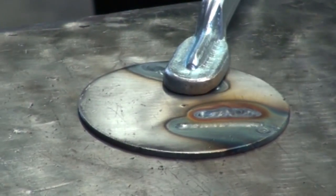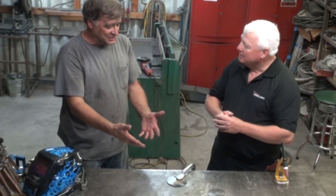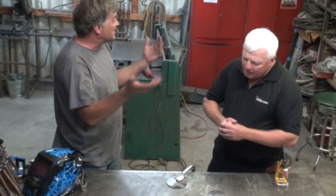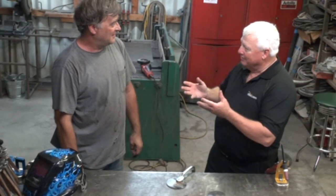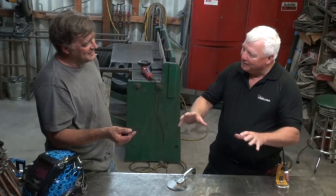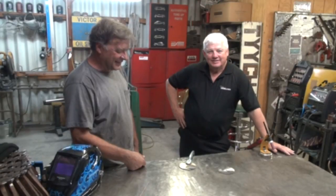Would I get the same kind of results if I was using the MIG and switched from mixed gas to argon, or forgot to turn the mixed gas on and had argon on it? Actually, no. You can weld aluminum very well with the MIG process using argon. The argon itself allows the material to melt and wet out — not perfectly, but it does wet out nicely. Decent. Great demonstration.